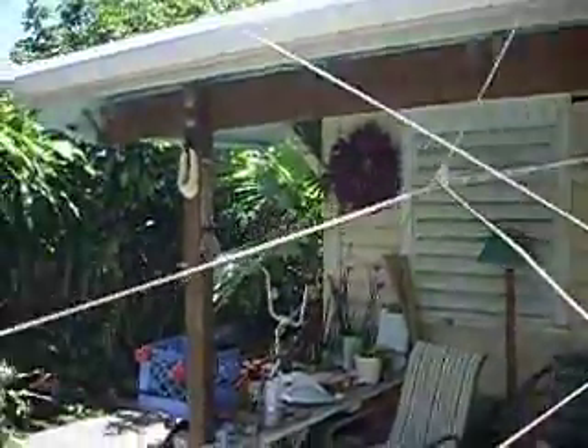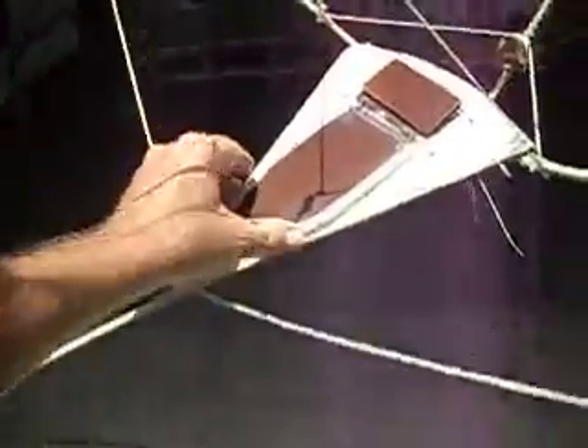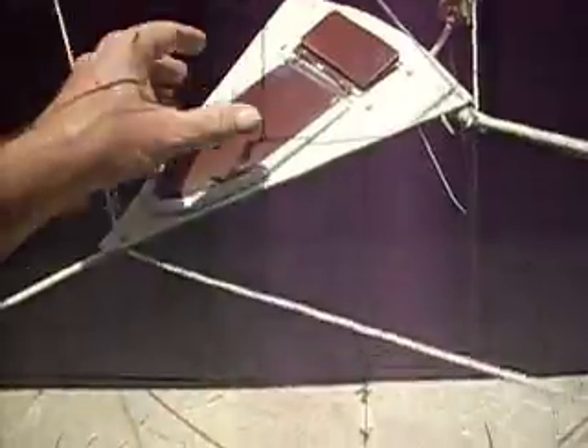The lift bags will be inside, pressing upwards on the four upper frames. I've got suspension lines rigged about halfway back to the stern, coming down to the main harness, which also has another suspension line going up to the apex of the four upper frames. And here's where they all come together and support the weight of the payload.